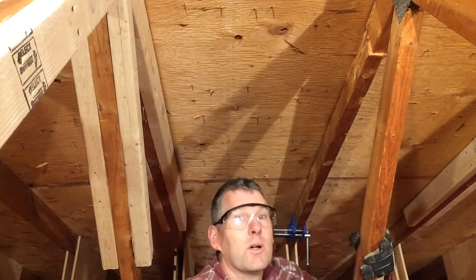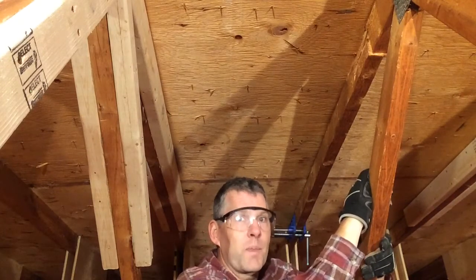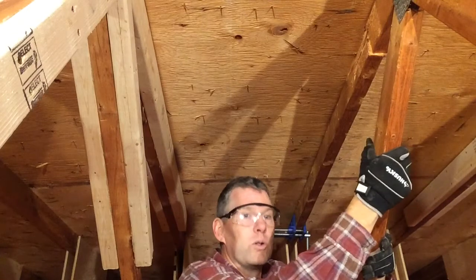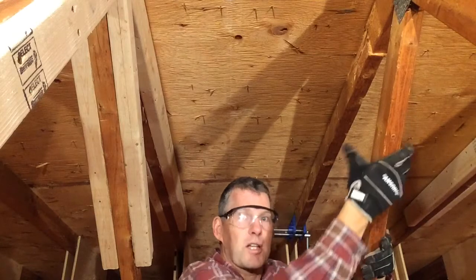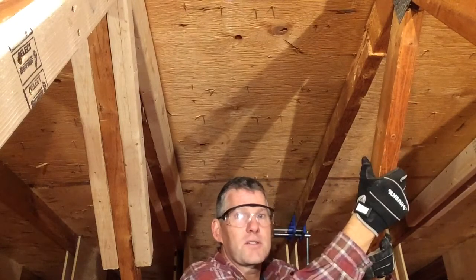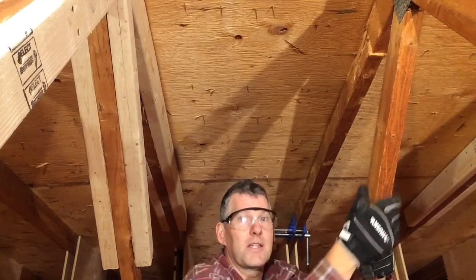In the next video I'm going to talk about getting the wood in place, finding its position, and drilling pilot holes. Because this wood is so old and so dry it's very brittle, and if you start driving construction screws into it to clamp the new wood to the old wood, it's actually going to splinter on the inside and you'll lose strength. So we're going to be drilling a pilot hole in the next video.